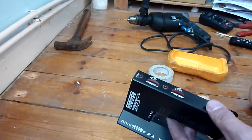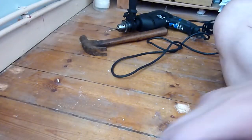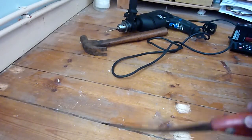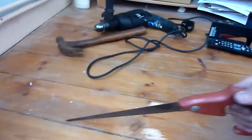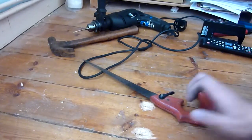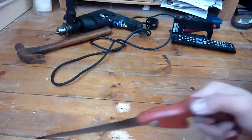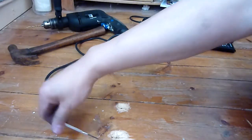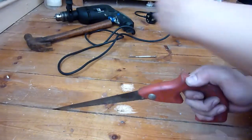It's not easy, this. You do not want to cut through your main support boards. Right, so I'll drill a couple of holes using this handsaw at a shallow angle. Just cut it through nicely. I don't want to use the machine. I don't want to use the electrical saw. That thing's brutal. You won't be able to feel this rate. When I come across one of the main beams going across, I'll be able to feel a difference. I will stop anyway when I get anywhere near it. I'll use a screwdriver, something to poke through as well. I get close to poke through just to check where the board is, where the cross board is.